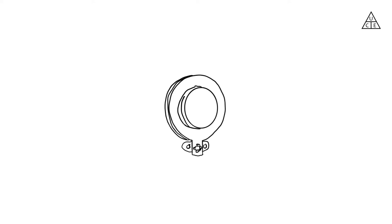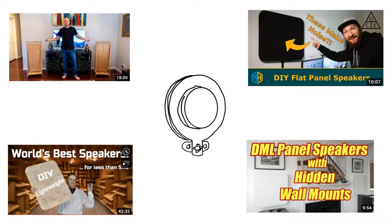One really cool way to make sound, besides using a regular speaker, is using sound exciters. These devices are really small when compared with regular speakers and produce sound by being attached to some surface and vibrating it. Several different makers use exciters to make really cool and good quality sound systems. Usually flat wood panels are used, but different kinds of materials can also be used. The main idea here was to replicate the way an instrument makes sound using exciters and exploring different wood shapes.